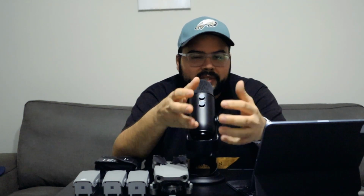This often happens when the battery reaction is not 100% efficient, so you start having side products in the reaction, and some of these side products are in the gaseous state. Because these batteries are sealed, there's no way for that gas to escape, so the battery will expand because the volume of the contents in the battery is growing. There's no exact science of what causes a battery to swell, but like I said before, the battery reaction will depend on the environment that the battery is in. Sometimes high temperatures will cause the reaction to generate side products. So you have to keep that in mind.